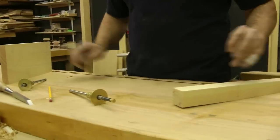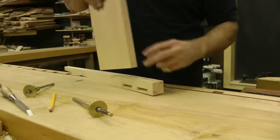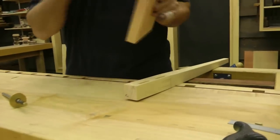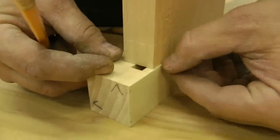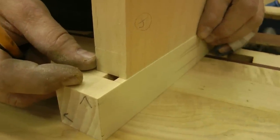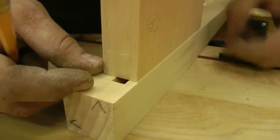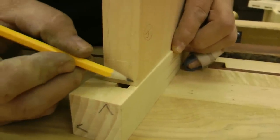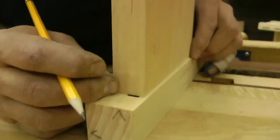So that's all set. Now, we have to decide where this is going to go in relation to the mortise on that leg. So if you want to get in fairly close right here, I've got to make sure that I've got enough reveal out here that it doesn't look like a miss. If you get too close like that, it would be too easy to have it disappear just in the process of cleaning these pieces up. So I need enough, but at the same time I want to have, I think I originally allowed, an eighth of an inch for a shoulder. So if we set it right about there,